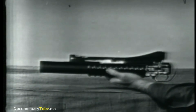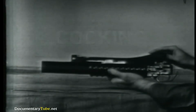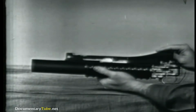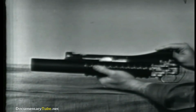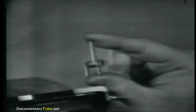The ejector is a spring-loaded type plunger. A compression-type spring causes the ejector to protrude through the breech face of the receiver prior to loading. When a cartridge is loaded and the barrel is closed, the base of the cartridge pushes the ejector rearward, compressing the ejector spring. During extraction, as the barrel is moved forward and is clear of the cartridge case, the ejector pushes the top of the cartridge base forward. The cartridge case pivots about the extractor and falls from the receiver. The cartridge is manually loaded into the barrel only after the barrel is moved fully forward and extraction and ejection are completed.